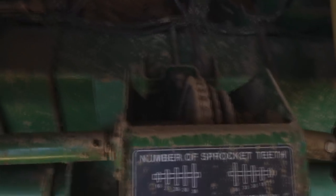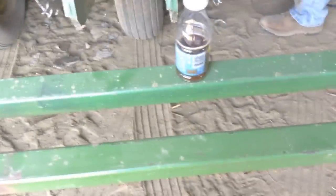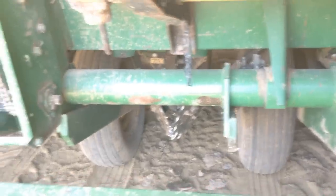It has a drive up here and there are little augers on the inside. This turns and brings the fertilizer out from inside the box and drops it down these tubes here. There are supposed to be discs mounted on these two bars here, and they go ahead of the seed unit and drop the fertilizer down where the seed goes.